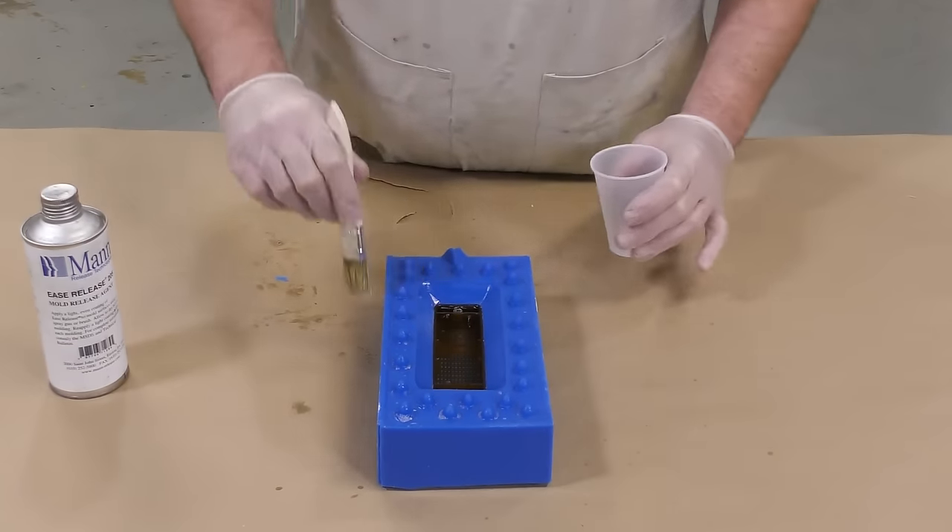Here's a little tip that I found works very well for this type of mold: I like to cut a small vent going away from the model — it doesn't vent all the way out of the mold, it just collects up top. Not only does it help the excess material evacuate out of the mold, it also creates a little pool of material so that if the casting needs extra material after air bubbles are evacuated, it can draw from that pool, creating a nice crisp edge all the way around with minimal defects.